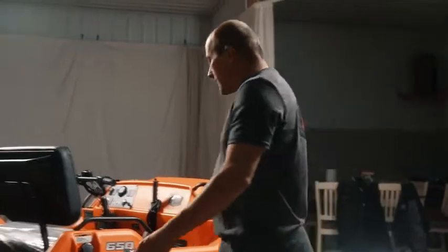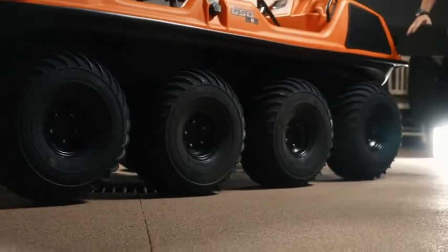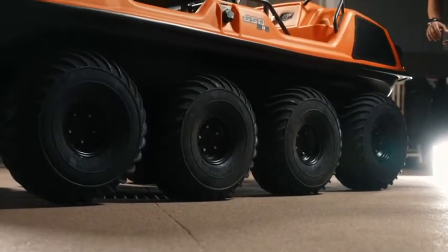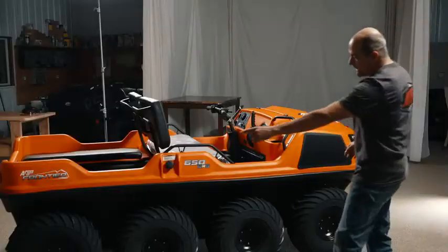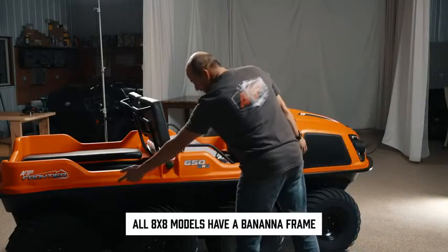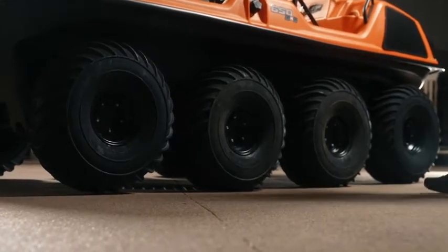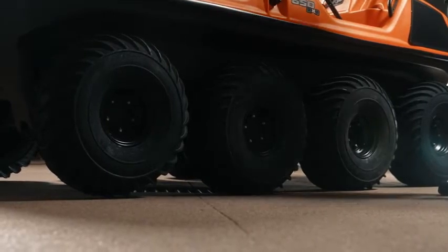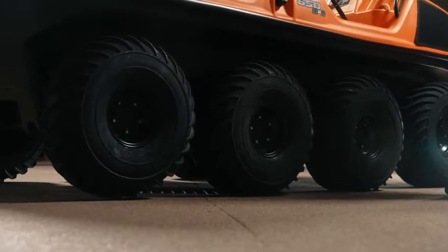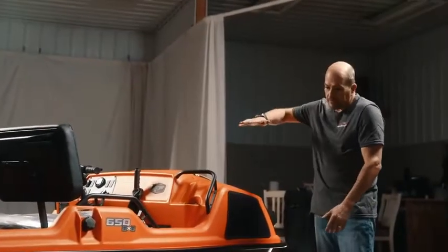On the side of this vehicle, you have four tires. If you look at the front of the vehicle, you'll notice it's squatted down with the engine in the front, and in the back it's elevated up just a little bit. All of the eight-wheelers have what they call a banana frame — the front tire and rear tire are seven-eighths of an inch higher than the center two tires. That's done so when you're running tracks or steering, most of the weight is on the center for steering, allowing them to turn circles a lot easier than a straight conventional frame. The reason you see the back end typically off the ground is because the engine's in the front — it kind of tips it forward.